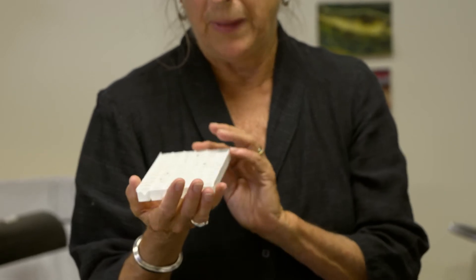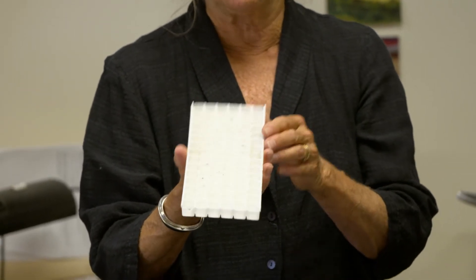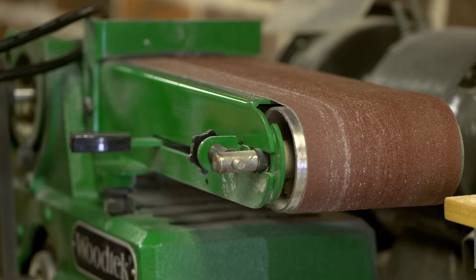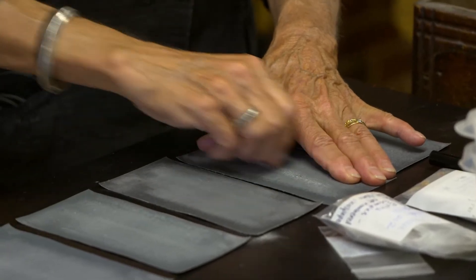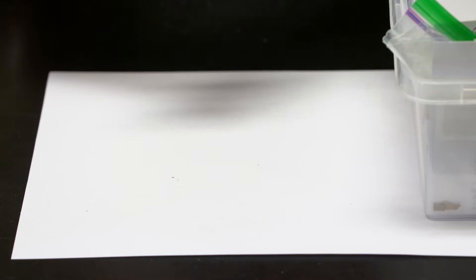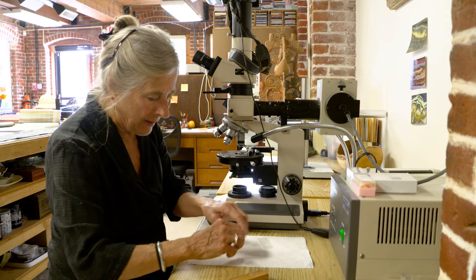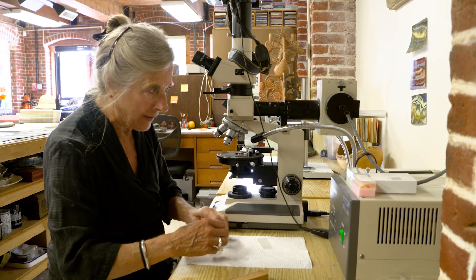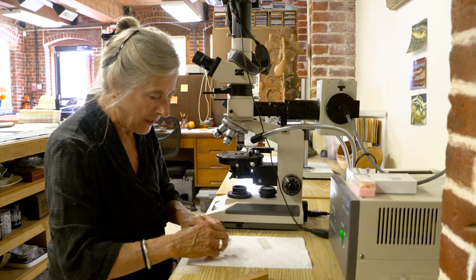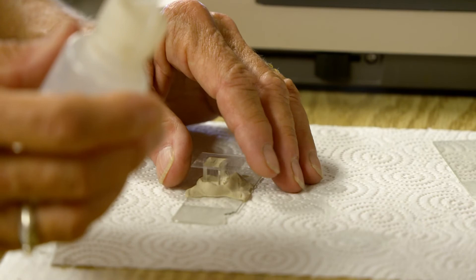Then I have to prepare them and mount them to look at under the microscope. I have this little ice tray here and I pour polyester resin into these little cubes, and then I sand them on the sander so that I cut through the face of the cube to expose it in cross section. And what we end up with are all these little cubes. I usually use a drop of liquid to put on there to saturate the surface.